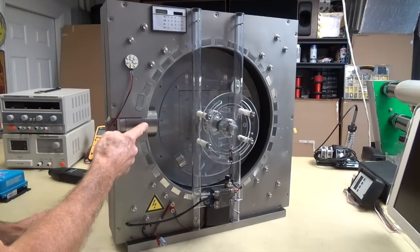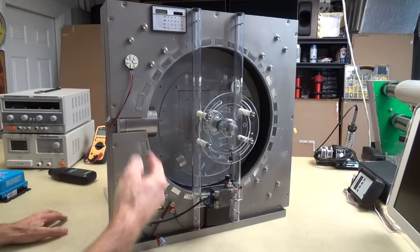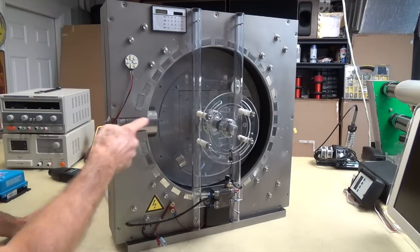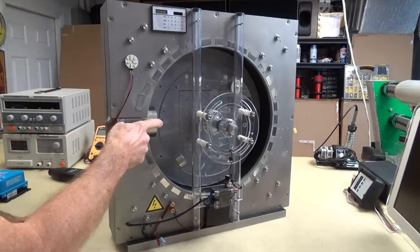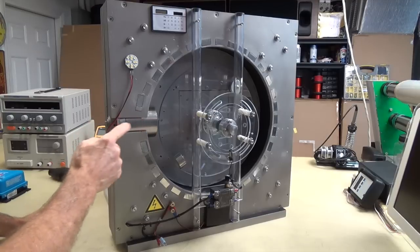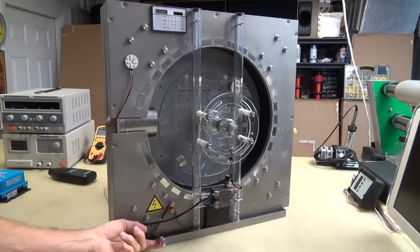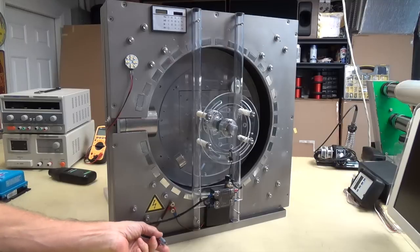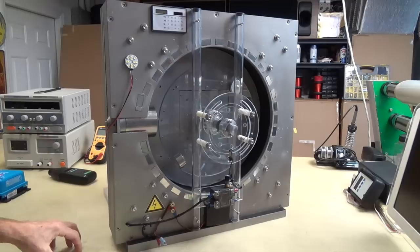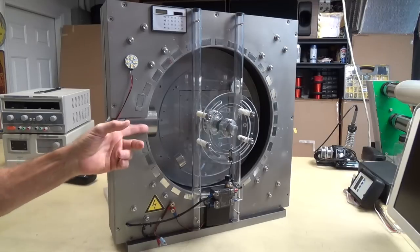So this thing just barely even bumps it. Like I said, if you're running this thing at 200 or 500 RPM, it's going to bump this sucker, maybe if it's 500 RPM, about 8 times per second. Well, that's pretty fast. And you also get the back EMF off this when the field collapses inside the electromagnet. I've got a couple of connections right down here that you just connect to, and you can recharge other batteries and utilize that. Otherwise, you're just throwing it away.